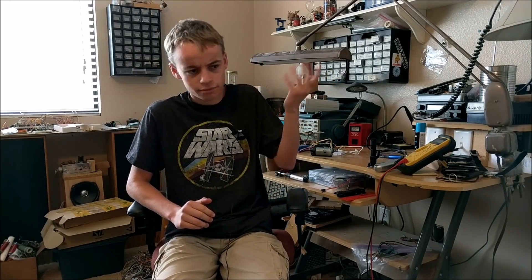So I decided to make the Tesla coil winder voice controlled. I recently got this Particle Photon from MIT — I won it in a contest. One cool thing about the Particle Photon is it's basically a WiFi-connected Arduino. I connected it up to the internet, wrote some code for it, then connected it through the IFTTT app to the Google Assistant. That way I can literally tell Google to set the power of the motor to whatever percent power I want, and it will turn on the motor at either full speed or hardly any speed.